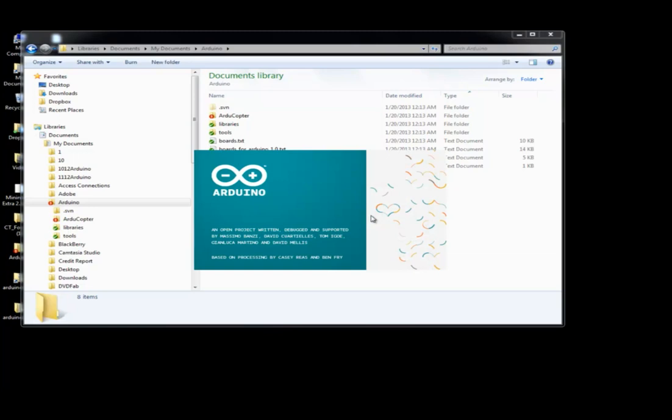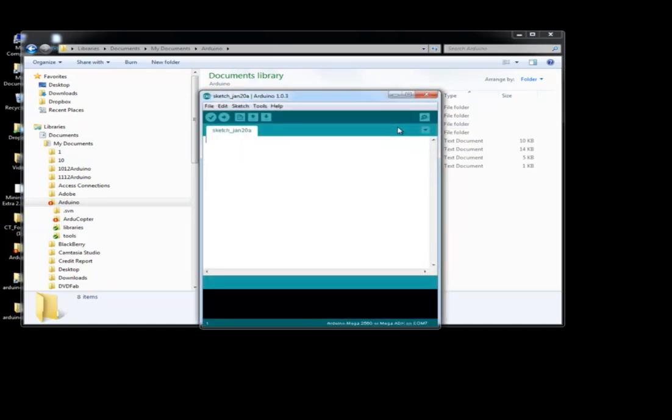And I'm doing this off screen, but what I'm doing is I'm grabbing my flight controller and plugging the USB cable into the mini USB port. Of course, that's the wrong cable. Again, as I mentioned before in one of my other setup videos, when you plug your flight controller in, plug the cable into the flight controller first, and then plug the cable into the computer.